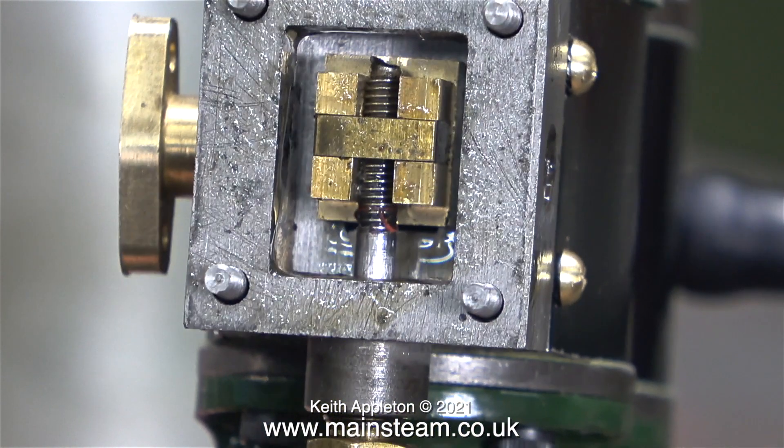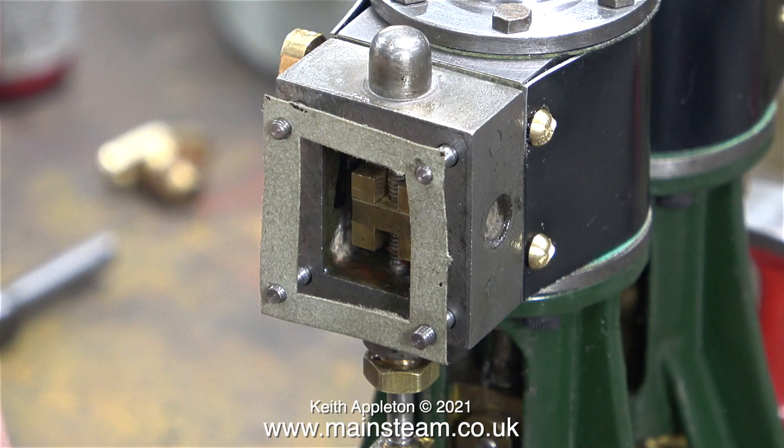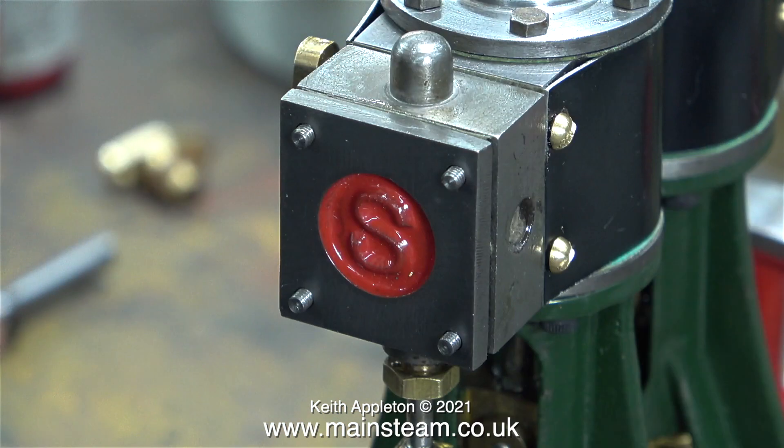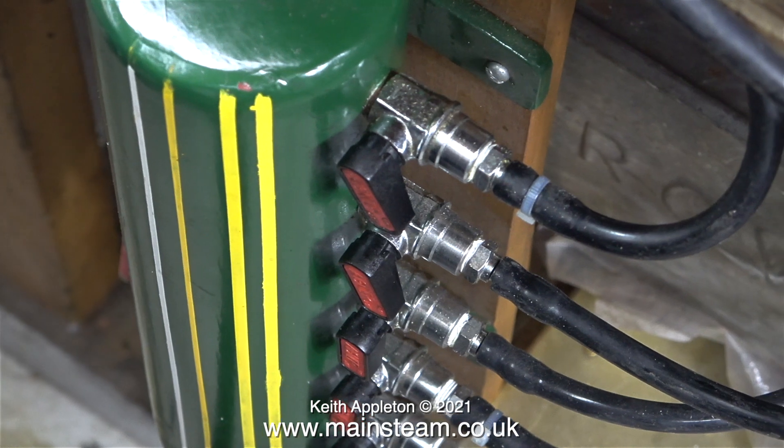It's not a problem because the O-ring is only a secondary line of defense — the Teflon-coated yarn would seal the valve spindle by itself. Time now to do a bit of gasket fitting. These are the gaskets supplied by Stuart Models; I thought I'd buy some. After the steam chest cover gasket was in place, it was time to fit the steam chest cover.